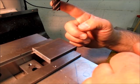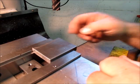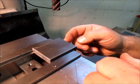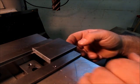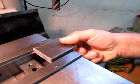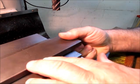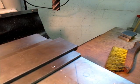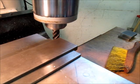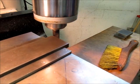Now, if this was a 2-flute end mill, it'd be spinning a lot slower, and I'd be lumping around, dump, dump, dump, dump. So the chances of snagging and having a mishap in climb milling are higher. With a tool change like that, you can safely do a little bit of climb milling on a manual machine and not have any worries. And you get nicer finishes. It uses less power. It's easier to turn the handle. I mean, there's advantages.